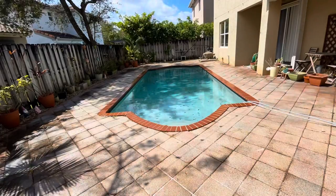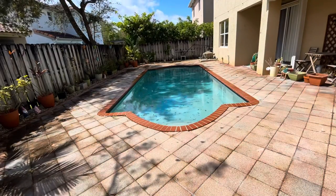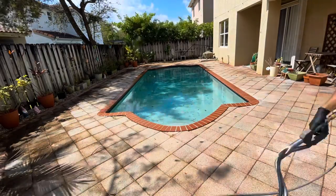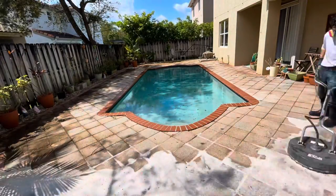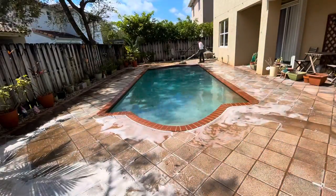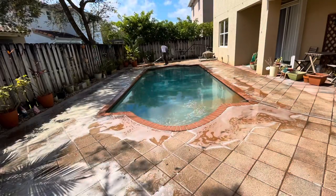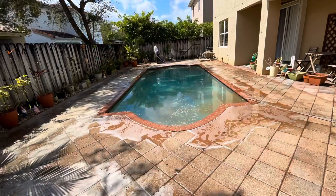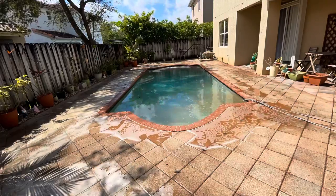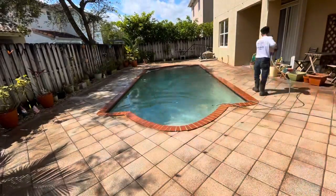This is the pool deck. I was just coating it with SH, letting it sit for about 5 to 10 minutes. If you're in the pressure washing business right now and you're not using SH or some sort of chemical, you're working a lot harder than you should be. SH makes the job a lot easier and look a lot better. You just gotta take your precautions. For the pool deck, it's pretty much just like any flat surface - just avoid getting water in the pool.